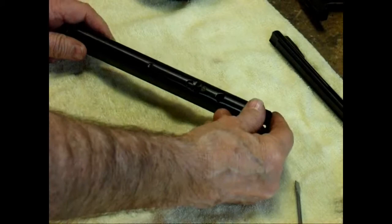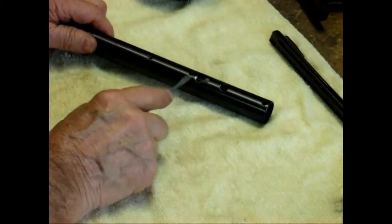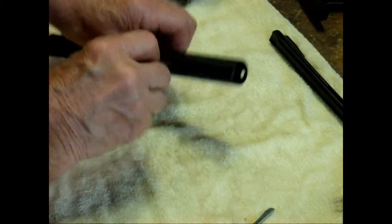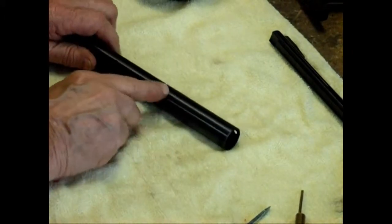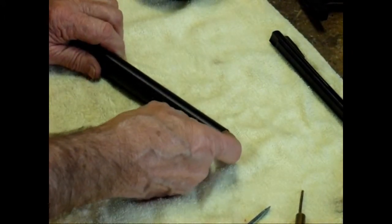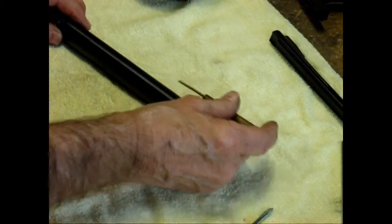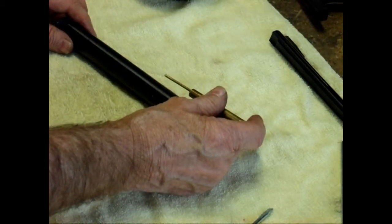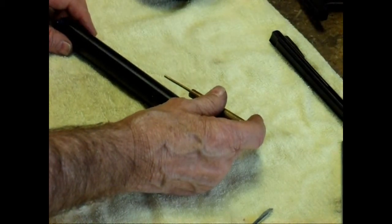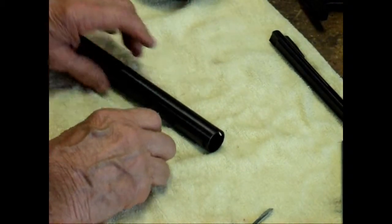Okay, normally to get the valve assembly out of this tube, you need to knock this pin out. You knock it out from the top to this hole. Now the trouble is there's a valve stem sticking out through the middle here inside. And you'd have to push that valve stem forward against the spring tension inside the valve assembly, and then use another pin punch to go through the top to get past that valve assembly.